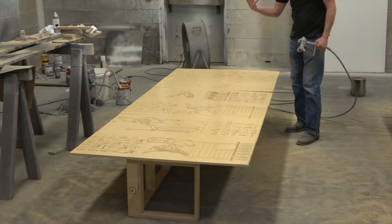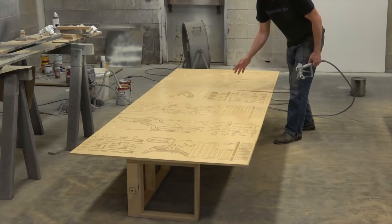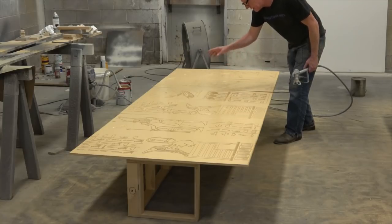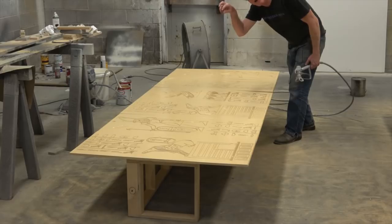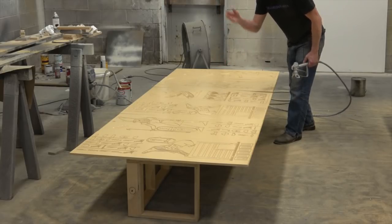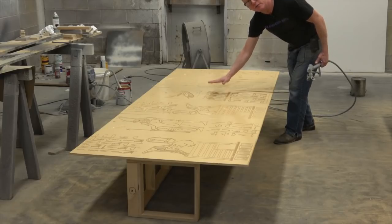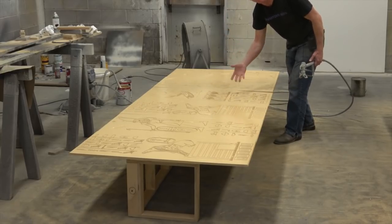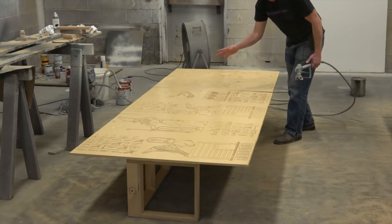What I need is for the paint to have enough velocity that it comes out of the gun and sticks in there. If I'm further away, aerodynamically — it's called the boundary layer, like the dimples on a golf ball — the air doesn't really want to get down in the cracks, it just sort of wants to flow out. As soon as it feels a cushion of resistance from the paint coming out, that'll keep it from going in.